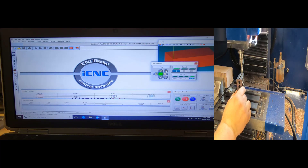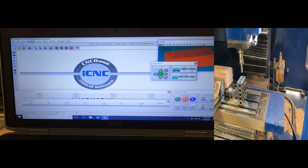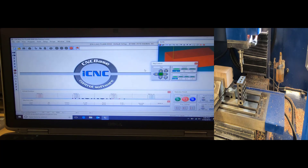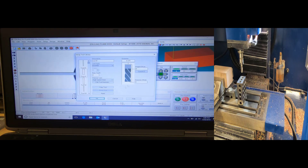Once I'm touching the 1-2-3 block I'll come back up slightly, switch to one-thousandth increments, push against the tool again, and click until my 1-2-3 block just goes underneath my tool. I'll go back to Tools > Setup Library with tool one selected — not tool zero, which is my reference tool. I'll hit Current Z; I'm a thousandth difference, which is exactly where I want to be, so I can hit zero. Back in the tool library it says zero, I click Apply, and tool one is set.